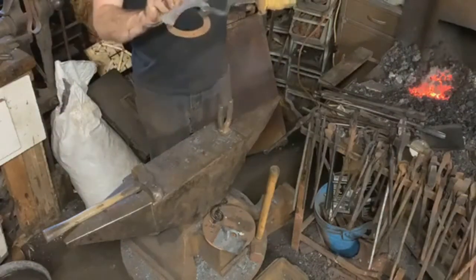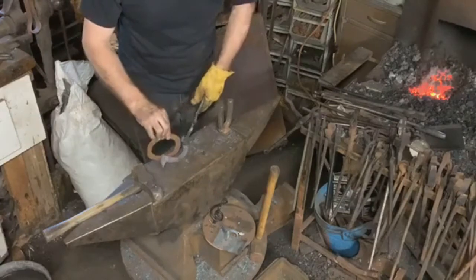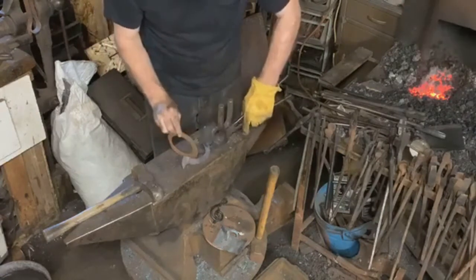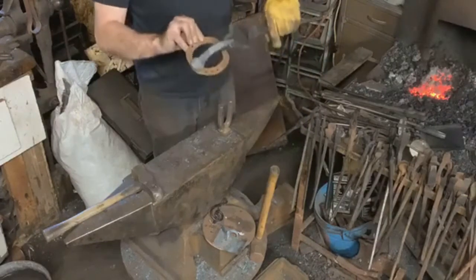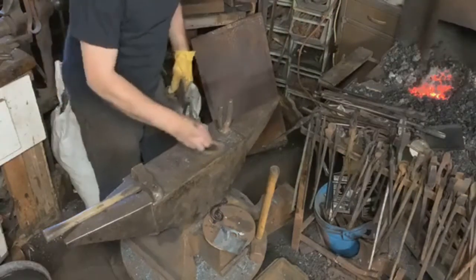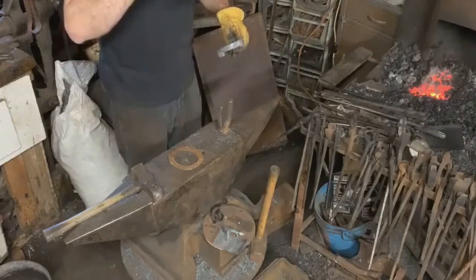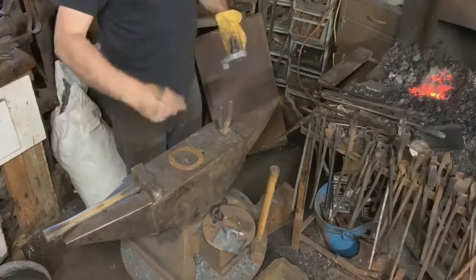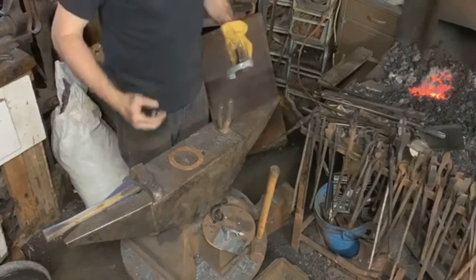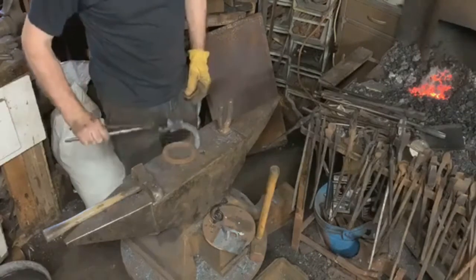That's going to rotate on that and then hit. I'm going to have that further up in the air so it can land about here. What you're going to want to do is make sure you've got a really tight-fitting hole through there. If you can, get a brass sleeve on the inside — because if you've got steel rubbing on steel, it's eventually going to wear and bind. Steel rubbing on brass doesn't cause as much of a problem. It's rare that I bother doing that, but you can. Alright, so there's our door knocker.